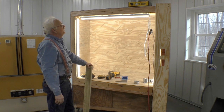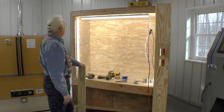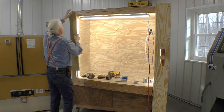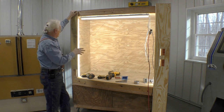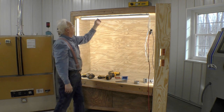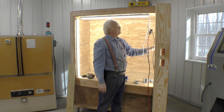That way you can turn the lights on to use the booth for sanding and whatever, and if we need the controller for the powder coat we can turn that on. We've got three LED lights — each one can be turned off individually — and the switches will be reachable once the cabinet is done. There will be a skirting that'll go up like that to hide the light source. I always hate it when you see the source of the light; I want to see the result of the light. If I put a screw around here it's going to hide these tubes.